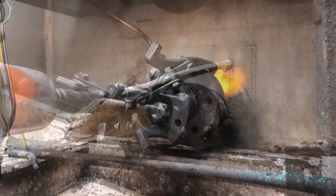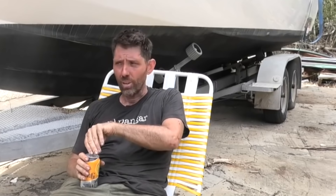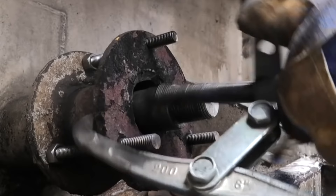While I was waiting for it to dry, I moved on to getting the flange off the end of the prop shaft so I can remove it. To do that I started by just spraying it with a bit of penetrating oil, then I put a puller on it and loaded that up with the impact gun so it had a bit of tension on it, then started to heat it. As it was cooling I gave it a couple of smacks with the hammer and it popped forward a fair bit — so I think we're home and hosed. Well I'm glad that coupling came off — I needed a win today. First thing this morning I went to finish the door and the welder had died, so I drove an hour or so up the coast to drop that off at a repair guy who wasn't there.